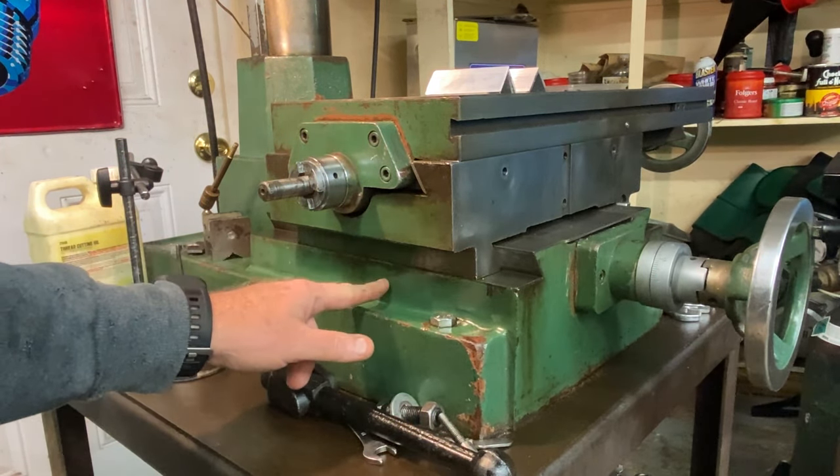There's the base for the y-axis — the bottom bracket — and that's going to go like that. I spaced these holes out so this thing is going to be spread about equally. Then all we have to do is mount the encoder in the location needed to make sure it's got the appropriate amount of space between the end of its movement and the encoder itself — which I think is 10mm. They say it's got to be 10mm away. When you slide that encoder in at the bottom it's got to be at least 10mm back from the end. That's going to be well within tolerance. I think it's going to be pretty good — good amount of adjustability.